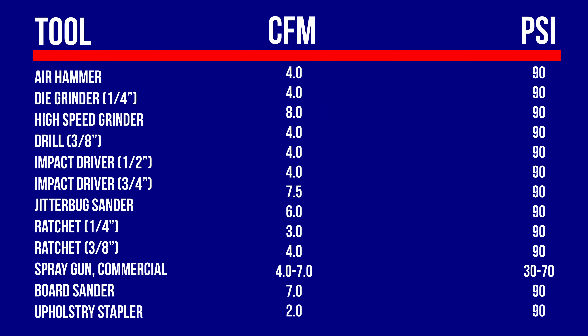The SCFM and PSI ratings are important because they indicate which tools a specific compressor can operate. When choosing a compressor, make sure it can supply the amount of air and the pressure your tools need. Always select an air compressor that exceeds the SCFM requirements of your most powerful air tool. Here's a chart to give you an idea of how much air common air tools require, but keep in mind this is only a general guide since some brands and configurations use more or less air. Simply put, always select a compressor with a CFM rating greater than your hungriest air tool. The greater the pressure your compressor produces, the wider the range of potential air tools you'll have. The majority of tools require 90 PSI, so you'll want to check the compressor's CFM output at 90 PSI.